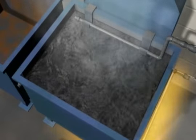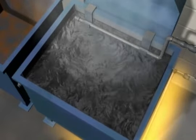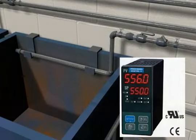The liquid in the tank steams and splatters when water is added, so stand back from the tank. An automatic controller for water addition is the best technique. Manual water addition requires constant vigilance.